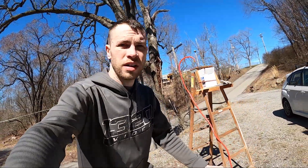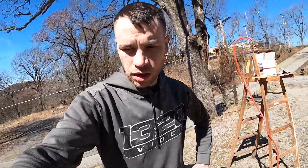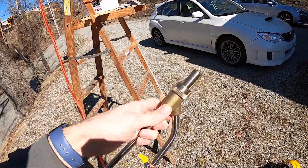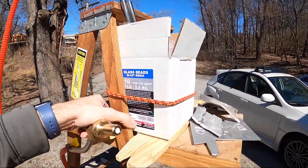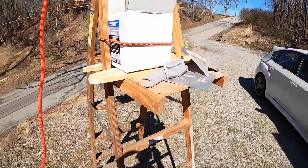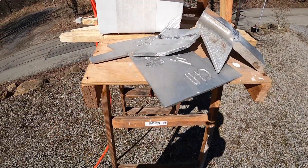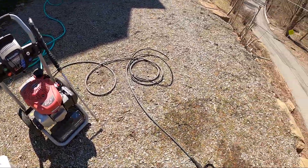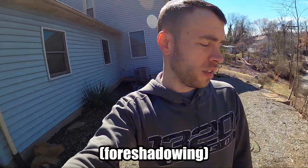More work on the manifold. I'm currently setting up a media blaster that attaches to a pressure washer — basically got this little ceramic nozzle and siphon tube, and picked up some number 10, 100 to 170 grit glass beads. I got some cutoffs from the manifold and some pieces of aluminum plate to test on. I'm going to see if this thing does good enough to do the whole manifold. Sorry about the wind noise — I had to do this outside because it's going to make a huge mess.